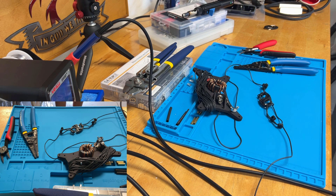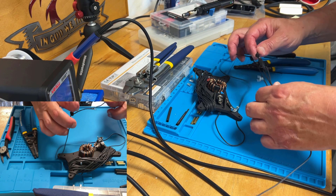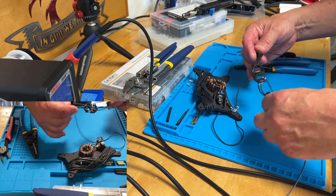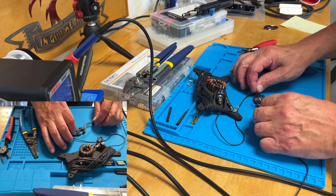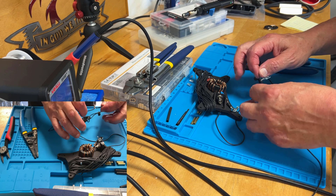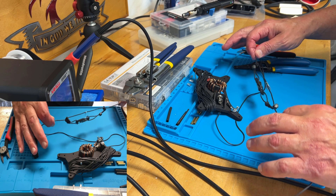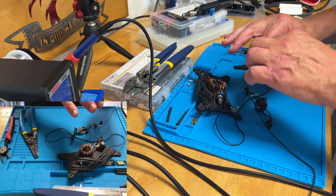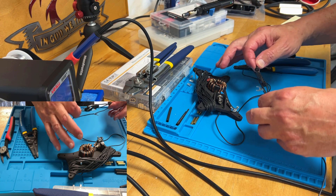What you're seeing in the picture right now is the link. I had to MacGyver it together in the field yesterday during tuning. Now we're in the workshop, we're going to do it right. When you're making a linked dipole, you want your stress or your strain relief to be with the carabiner and anything associated with the carabiner. Yesterday when I was tuning this antenna up in the field, the stress ended up here with this connector. We're going to have banana plugs here, so we want to make sure we don't have stress on our banana plugs because we don't want the tension pulling them apart. We want the stress and the strain relief to be with the carabiner.